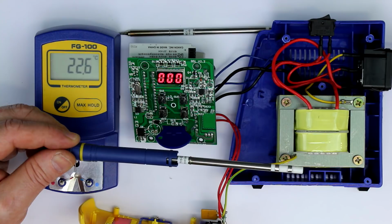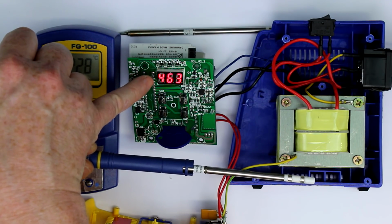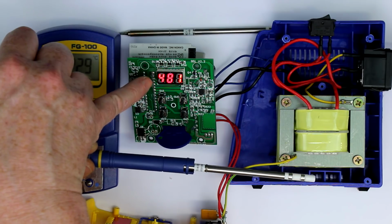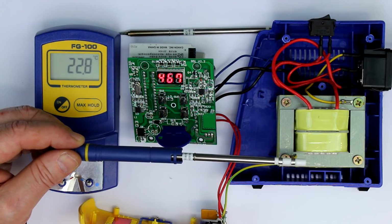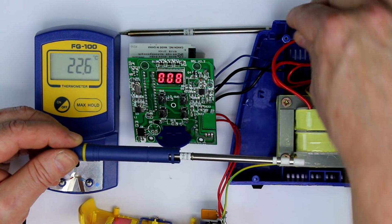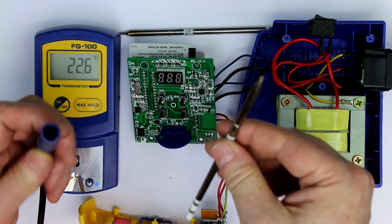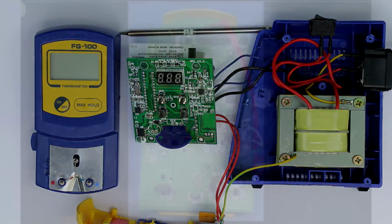and no, it gives strange display values, and you can see when it tries to turn on the heater that the brightness of the 7-segment display goes down, certainly because the voltage on the transformer goes down, but it has no direct way of detecting a faulty inserted solder tip. So I don't think this is really such an important feature, but anyway, to be 100% sure, the people at Hakko had a provision to display this wrongly inserted solder tip.